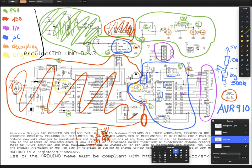Sometimes when this guy starts to activate other parts of the circuit, they might draw a lot of current. And when this can't react fast enough to the changing current, it uses these capacitors, which we've spread everywhere, as kind of like local batteries. So there's only a tiny bit of resistance between the VCC and ground and this capacitor. So rather than getting all of its current from up here, which is already trying hard enough to keep up with the rest of the circuit, it'll just get a little bit of power from here.